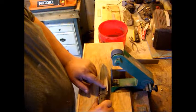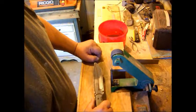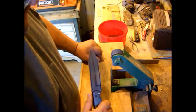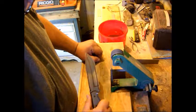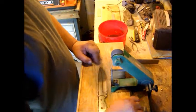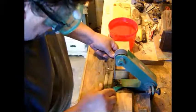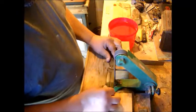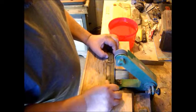After we temper this edge, and we're in here laying in a nice sharp edge, every couple passes I'm going to be dumping this in water to keep it from getting too hot. Because if we get it very hot and discolor this metal at all, the temper is done and we go back to the heat treating. And that's where you end up with cracks and flaws. So we don't like doing flaws. Alright, let's keep going.